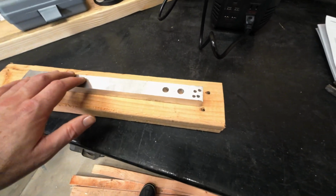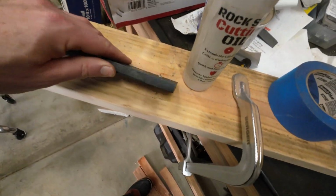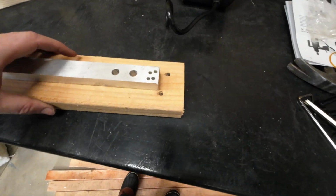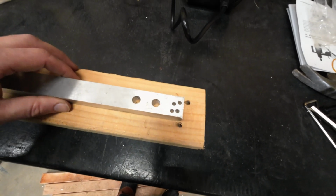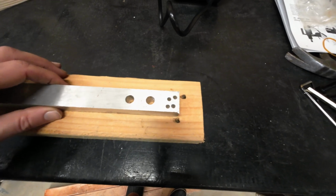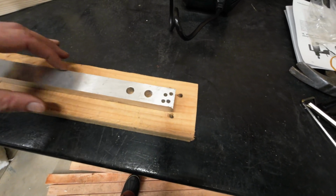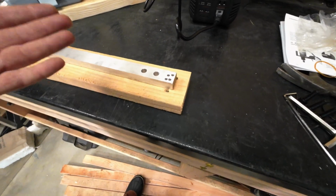And since you guys are still crying about it being on aluminum, we're gonna do some steel too. Just got like some 1/2 inch steel bar. We'll do the same holes, M6, M12, see how it does. These are kind of some of the sizes that I do more often. I'll do some smaller sizes, which is probably the size that's going to break some bits. M3, M4, M5. Just doing those by hand, it's super easy to break those bits, so I'm not super excited about using this thing for that. But we'll see if you set it up, if it kind of protects it or what it does.